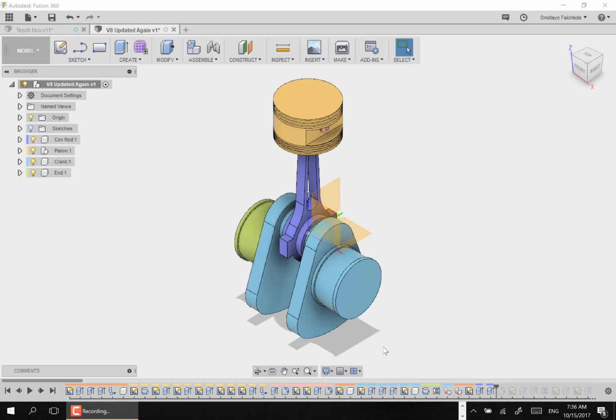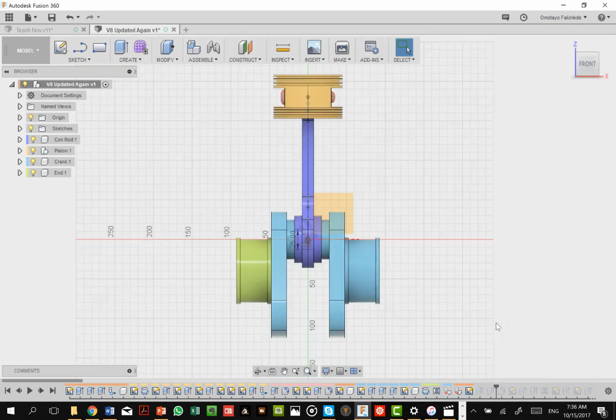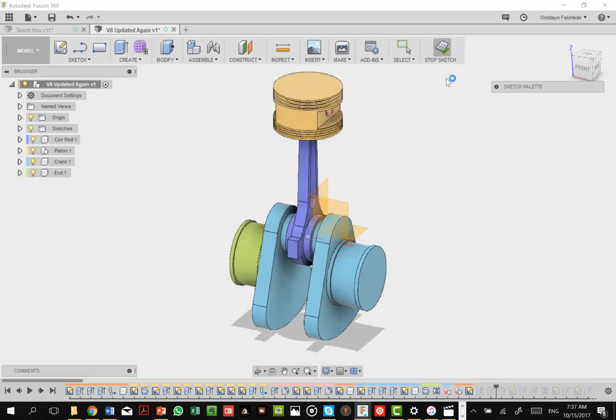We begin this section from the complete single engine position we reached at the last lecture. At this point, we just make the modification on the connecting rod at the crank end of the connecting rod. You can see this rectangular object here that was created by doing a sketch. The sketch is what you can see now. Maybe we should edit that sketch to take a closer look at it. The sketch is this 25 by 15 center rectangle here. And then let us say end sketch.